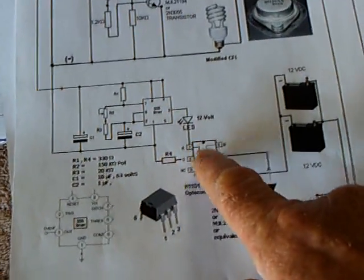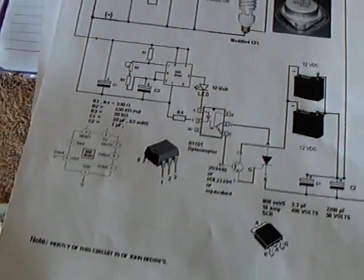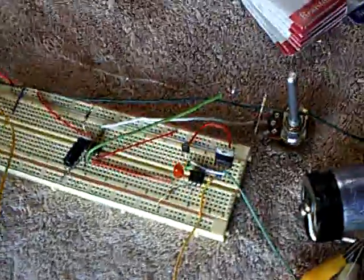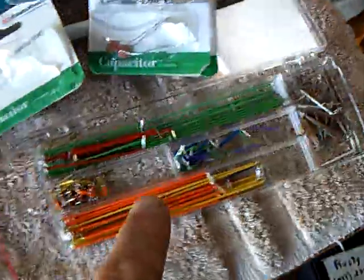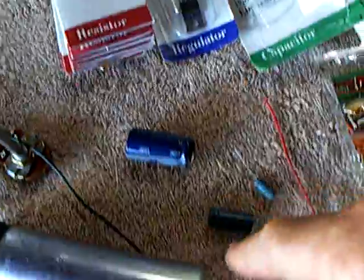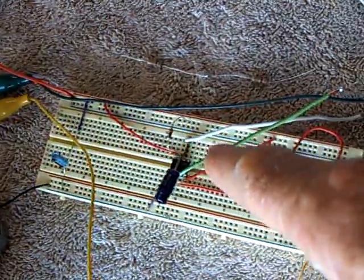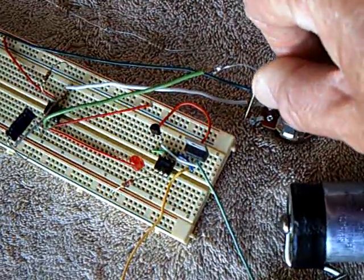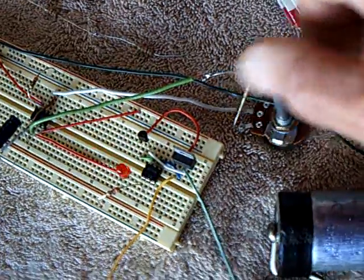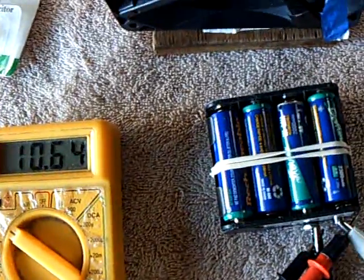This was very hard for me to understand how it worked, but I decided to just breadboard it. These wires plug in and plug out — they come in a little package — so it makes doing the circuit really easy. You can change your capacitors and resistors in the breadboard to see what happens. That's the pulse going on right now, and the potentiometer lets you increase that pulse, which loads up the energy into the capacitor before it puts it into the charging battery.